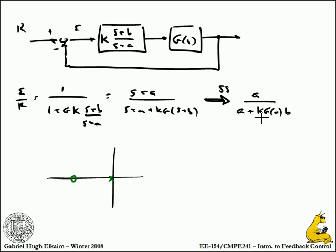And one of the things I can do, be careful, by the way, about putting zeros in the right half plane. It's a legitimate thing to do, but they're a little squirrely. They're called non-minimum phase zeros, and they make your system respond by going the opposite direction first. So generally you'll do it because, hey, it works. But we'll get there. This is getting into Bode. We don't want to go there just yet.